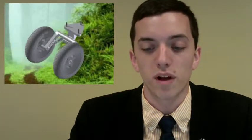My final design is a simple off-road tire with thick rubber inflated tires and durable steel frame and bearings. The tread design is a simple V design which is raised well off the ground of the tire to allow for grip and traction. Finally, I made the tire's diameter 9 inches. This increased the clearance of the board from last year's group and allowed for a smoother ride. This clearance was necessary because of the space required by the aquatic impeller, which is mounted on the bottom of the board.